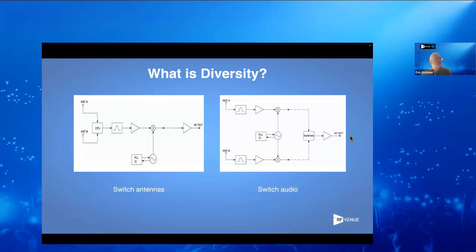There are some other schemes. If you have digital wireless, you can use something called vector diversity. When you have digital modulation, you get what they call the cliff effect, right? With digital things, like your TV set, it works and then it just stops. It doesn't degrade. It just goes until it falls off the cliff. Because of that, there's some manipulation you can do with digital signals to try to straighten the phase out so that they don't cancel. And we're going to talk about that in a minute. It only works on digital.